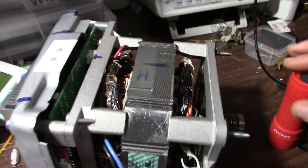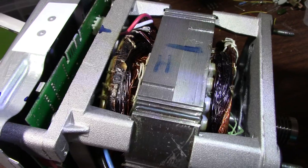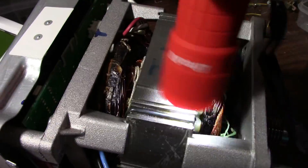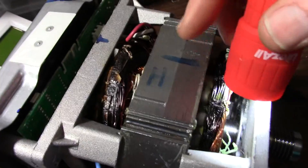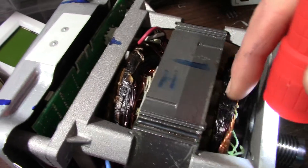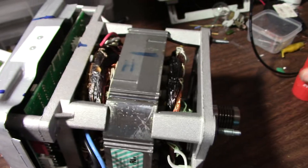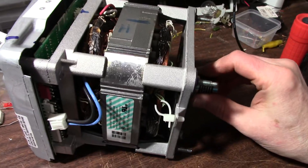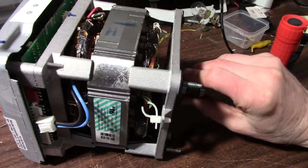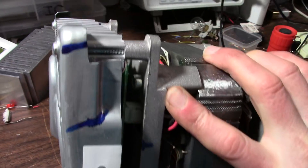It has a control board on it. You can see here some bad things happened — these windings are darkened, they overheated. You can see it burned off the wrapping cord and these little plastic sleeves that go through the core kind of melted too. So yeah, really overheated. The weird thing is the controller board still tries to operate the motor. I can see it still try to work it back and forth in agitation mode. So I'm gonna pop this apart and see what failed.